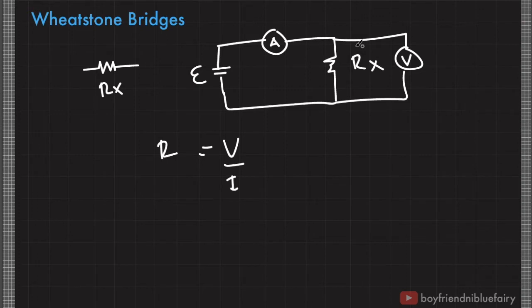However, recall that in the design of the ammeter and voltmeter, an ammeter requires a shunt resistor while a voltmeter requires a multiplier resistor. So in the process, this ammeter and voltmeter can introduce some errors because they can introduce potential drops in measuring the original resistance of the resistor. In connection to that, we explore another instrument, the Wheatstone bridge design of an instrument that can measure resistance.